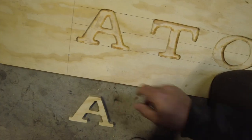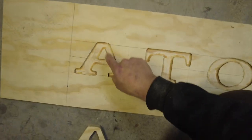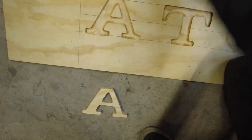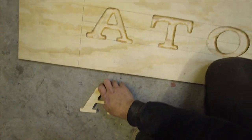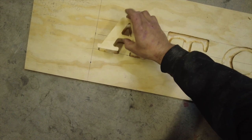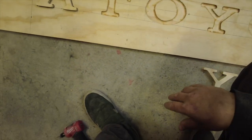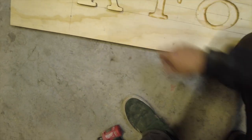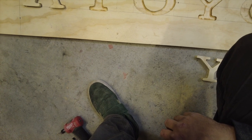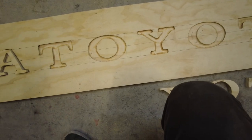And then what I can do is basically put the aluminum behind this piece, mark those holes through just with a Sharpie. And then when I put the aluminum on top of this board, I can just set this and line up the holes in this with the marks on the aluminum. And that's the best way I have thought of keeping the location of these into the aluminum. And that way I can know right where I need to hammer and just hold it there as I hammer in the letters. So that's the plan. See if it works.